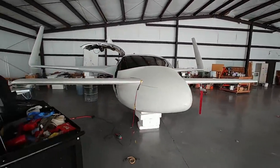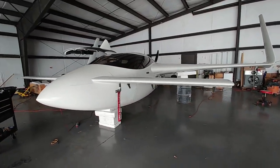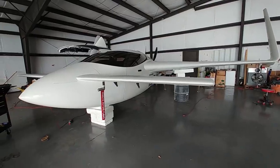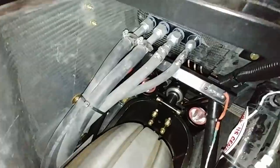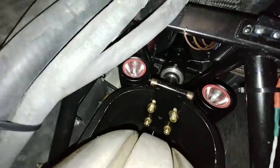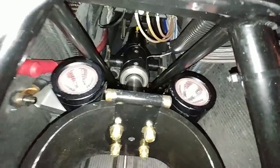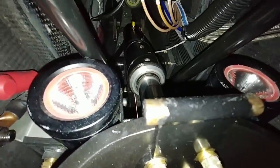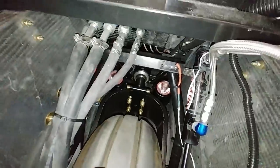The next thing — not really urgent but needs to be done eventually — is the alignment of the landing and taxi lights. Now that the gear leg is more vertical, those lights are pointing toward the ground quite a bit, and when the gear is retracted they're actually touching the lower arm on the front edge. I'll need to move them backward on the fork and angle them upward, which will require a new bracket.